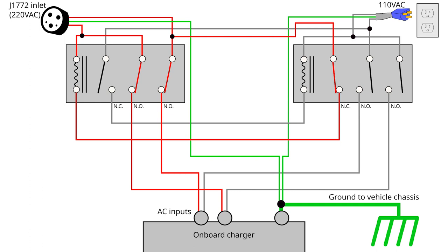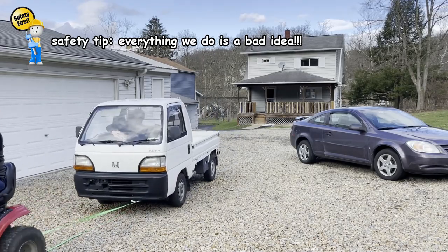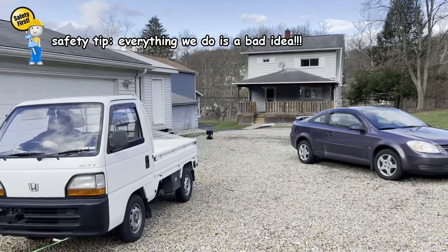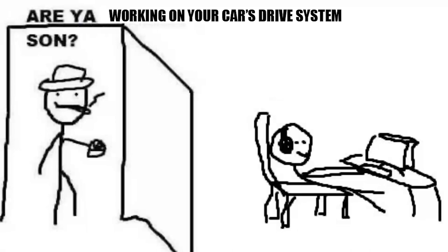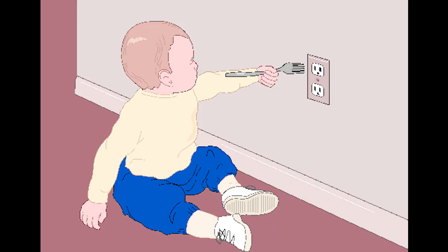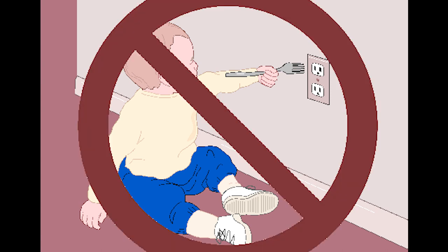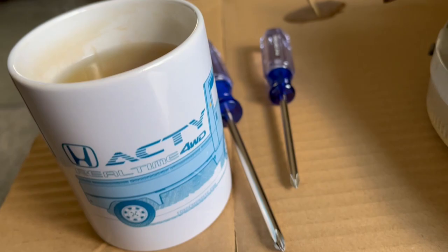While we're looking at the big picture of our car's three circuits, the charger circuit will be grounded to the chassis per its instructions. The car's DC drive circuit will not. If you ground the DC circuit to the chassis, you're asking to die. I know this channel has a lot of jokes and silly sound effects, and part of the point is to give other folks the impression that converting a car to EV is doable — but please remember, our videos don't show the hours we spent researching this stuff and double-checking our work. If you do this yourselves, our dumb YouTube videos should not be your only resource. High-voltage electricity can kill you, and so can any car. Don't ground your drive circuit to your chassis. And as always, if you want to help buy parts, check out the links in the description.